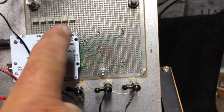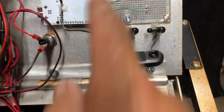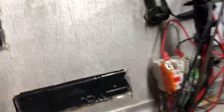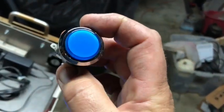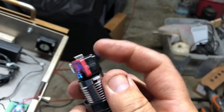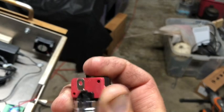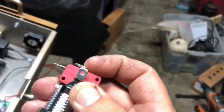Here's where you put all six of the switches, two wires each. If you actually connect something to each of those, it'll actually light up that corresponding light. As far as my buttons are concerned, all they are is just an arcade button. Here's a blue one — it has a micro switch inside. The outside two wires are the LED, and then the ones on the switch, the red and black, that's going to be your contact — that'll close the circuit.